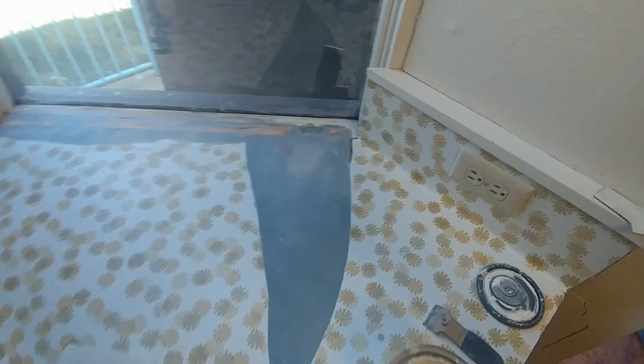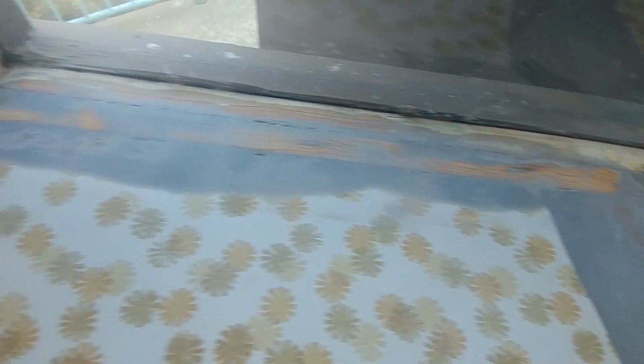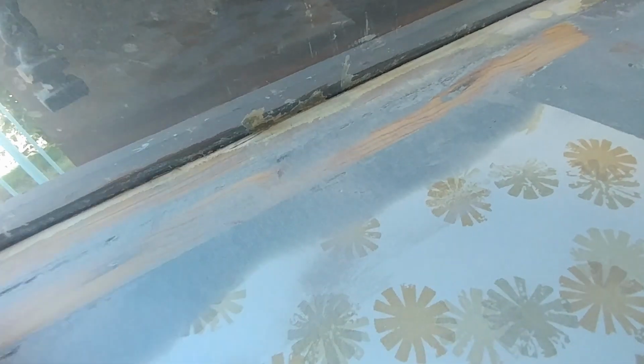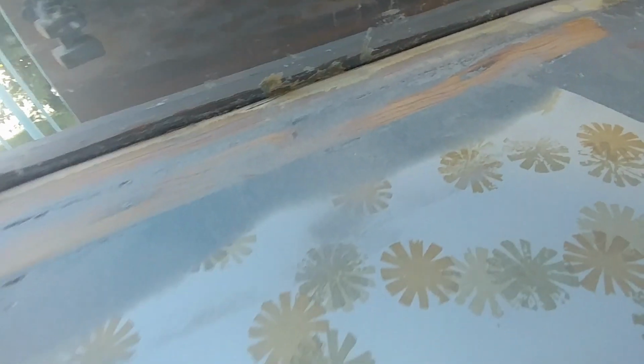What we've done, we did our Bondo glass, filled everything in, leveled everything out. Now, they had a little issue with termites, which you saw earlier, and this was very squishy right here. Now, yes, we would normally take this out and replace it, but that wasn't in the budget, so we just decided to go ahead and fill it with the Duraglass. Now it is no longer squishy, it's actually pretty hard.